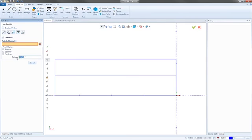Now I'm going to go with the same distance of 6.25 actually, because we got to go from the front face here straight back. So we're going to go straight back that far. So this will be the first ledge, and then we'll have a drop down for the groove there, come back up, and then we'll have that angle go wherever it needs to go. So for the other side of the groove, I'm just going to change this dimension to 9.38 and go from the front face straight back. So that's the width of the groove.